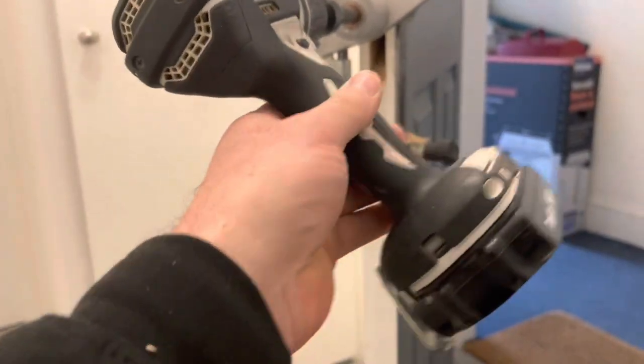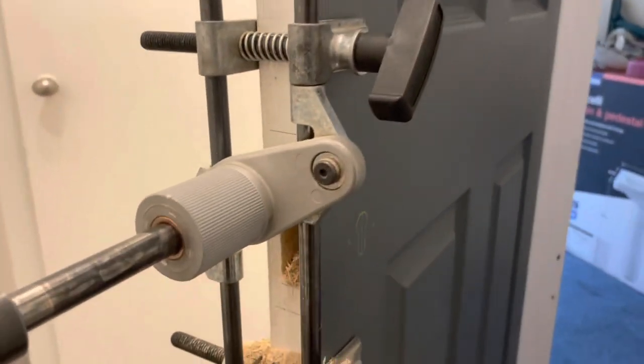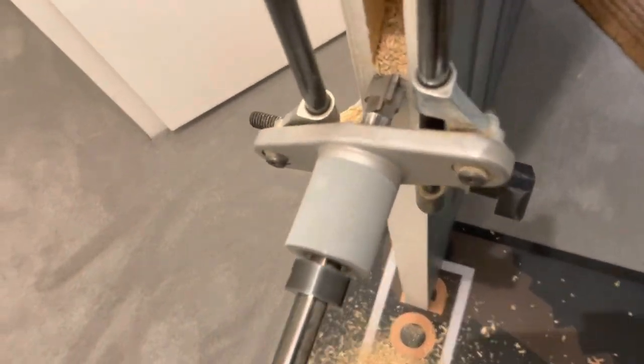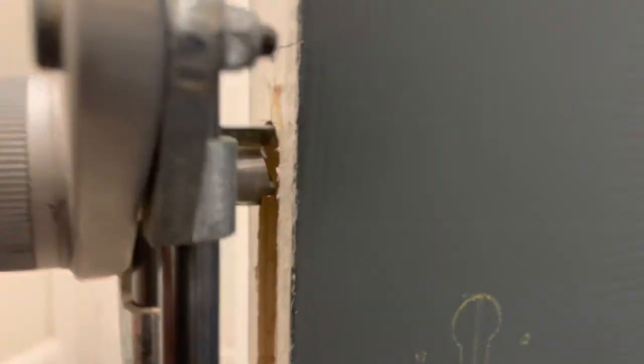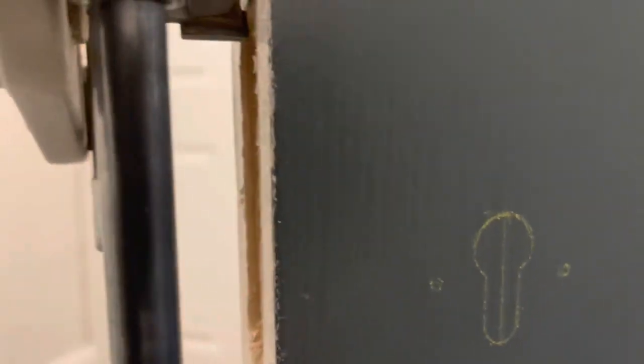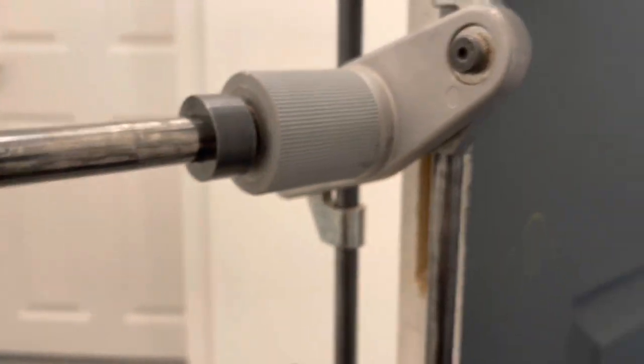As you can see, I've just used my Makita cordless on this one — I couldn't see a plug socket in there. We'll get the bit changed over — that one there for the 25mm faceplate — and get that cut out. So now this is set up for the faceplate; we've got the 25mm cutter on there. I've adjusted the height so it's right on the line there. It's about a mil short, so I'll adjust that quickly and set the depth for the lock and the faceplate — get this chopped in.